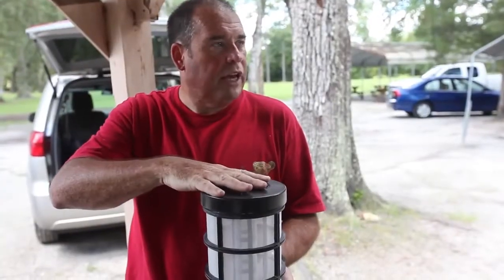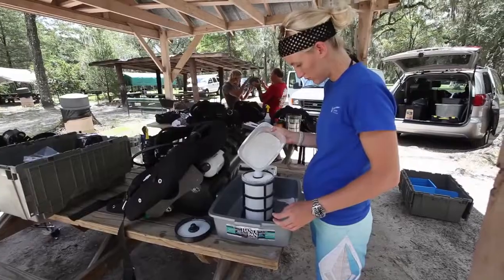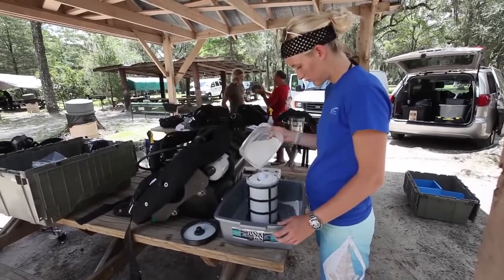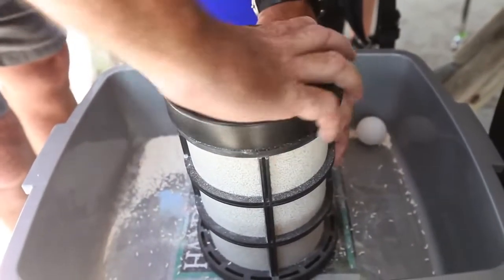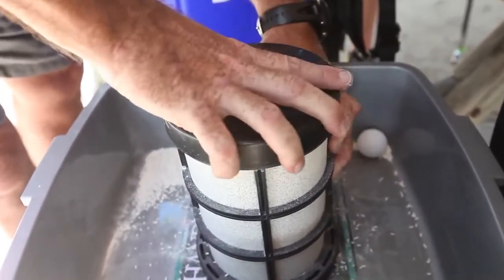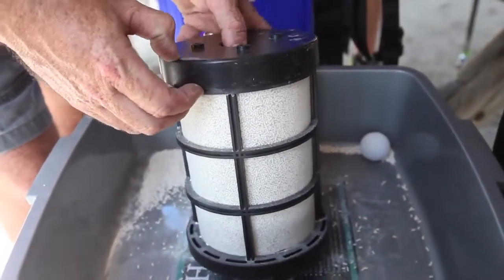You're going to top it off again. Repeat the sequence. That'll be time number two. You're going to take this off again. Fill it all the way up. Tap it down again. Put our sponge on. And again, now we're going to screw our cap down till it stops. See, again, it's not flush. So now we're going to tamp it down again.